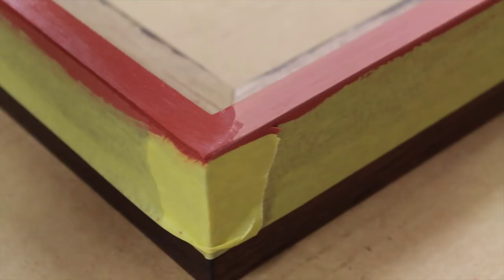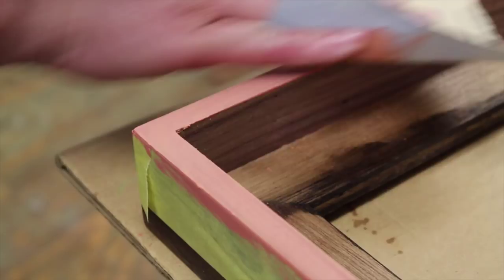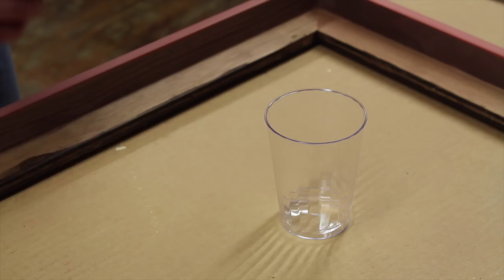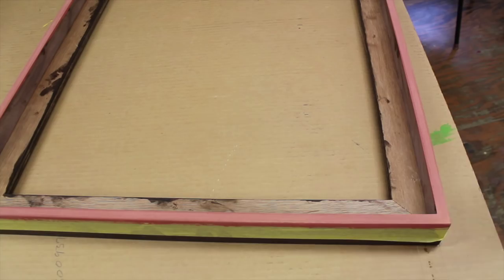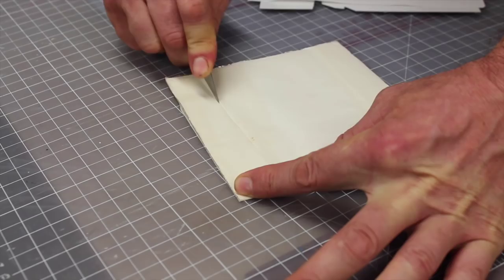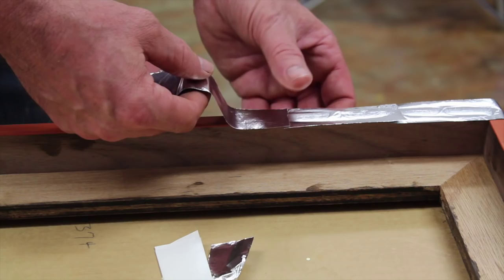I painted the frame with three coats of clay, sanding between each coat, and I also sanded the last coat. What you're going for is a really smooth surface. The next step is the sizing — paint the sizing on the clay and allow it to dry for about 15 minutes. The metal leaf comes in five and a half inch squares and I cut it into one inch strips when I'm working on frames like this.